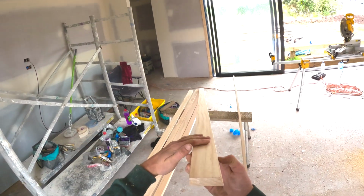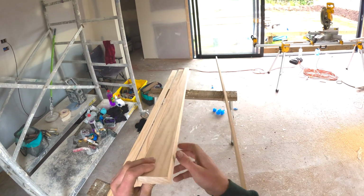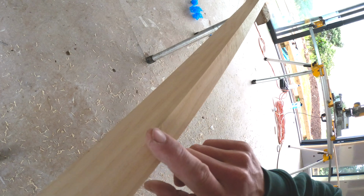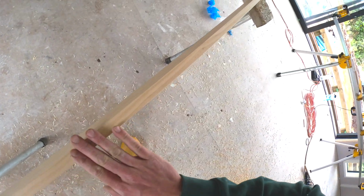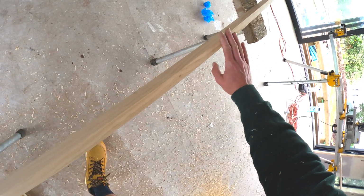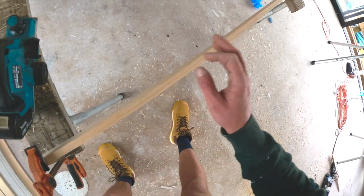So now that I've ripped up my 60x20 architrave that goes in the bathroom, I've got a ripping mark along my bevel edge through here. I need to make sure that that's nice and smooth before I put it in, because that's going to be a pain for the painter to sand and paint, and he probably won't do it. He'll just paint over the top of it.